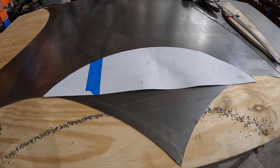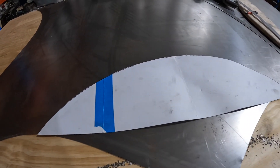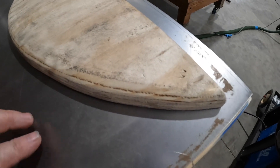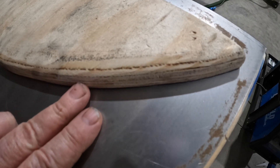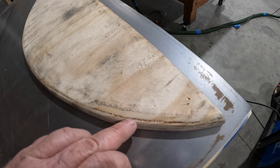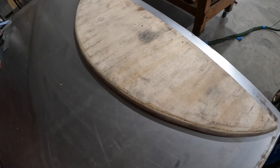We're going to make that around about 11 inches wide. I'll show you how to cut out some 18 gauge sheet metal, cut it to the shape of the template, add a little bit extra on the top, then we can roll it over a form. Here is the plywood form that I've made up — I've made it to the shape of the template, and I've used a 12 millimeter round-over bit to round over the edge. I'm going to cut a piece of 18 gauge, 1mm sheet metal, put it on top, clamp a similar size piece on top which sits just short of the roll, then hammer the sheet metal over this edge to get a nice rolled edge.